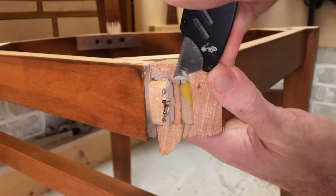Now I'll put the seat on and take a look at what it looks like. That's pretty good. I've got the touch-up marker in my hand still, so I'm just going to touch up these two spots here — this is where the chairs come in contact with a table when they get pushed in. Sometimes you get bruising on furniture, so that'll just make it less visible for the customer. I hope you've enjoyed this video on how to make a bad furniture repair a good furniture repair. If you haven't subscribed yet, click over here and click the bell icon to get notified every time we make a video. Thanks for watching Fixing Furniture.